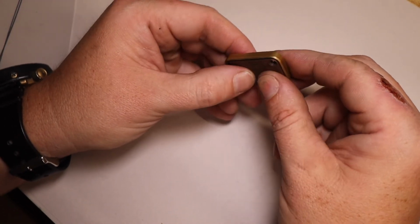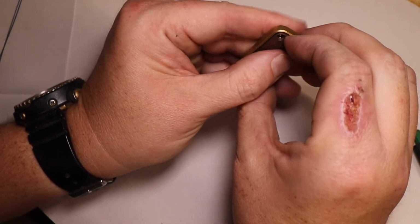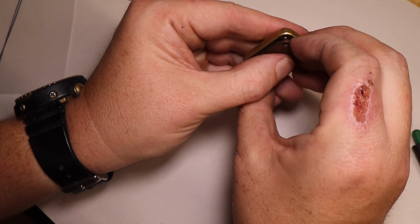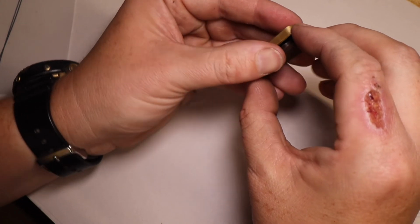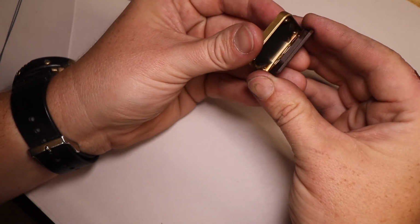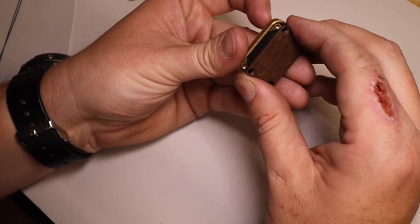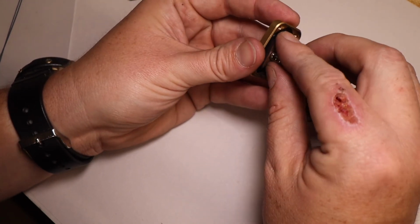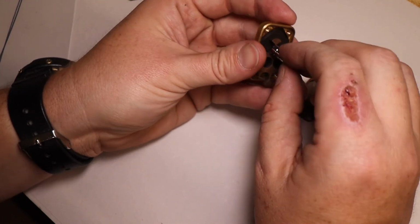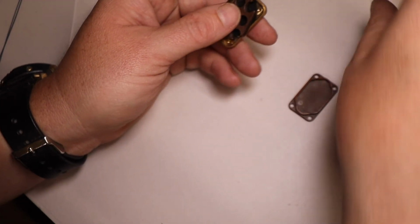And we're going to let it go, but we're going to ease up easily. I'm going to try to catch my fingernail on the edge so that I can control it as it comes apart. And it hasn't popped apart yet. Alright, so I would recommend in this situation, see those magnets are basically cocked cannons, so, oh, there they go. So you saw how they popped loose and popped together. Alright, I'm going to move that stack of magnets around to the other two that were hanging, and then you've got a relatively safe stack of magnets now.